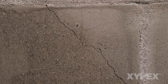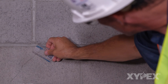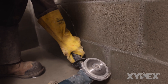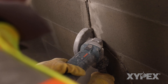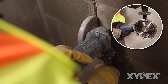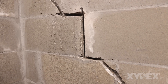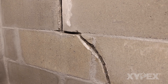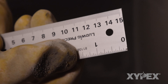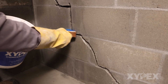Where cracks in the blocks themselves are seen to have been leaking, are actively leaking, or where cracks are larger than 0.5 millimeters, the following steps are recommended. Using an angle grinder, cut a slot along the crack using a crack chase blade followed by a tuck point blade. Angle the tuck point blade to both widen the slot and to create a dovetail profile. Cut the slot to approximately one half inch or 12 millimeters wide to a depth of approximately one inch or 25 millimeters deep. Clean the slot and the area around the slot thoroughly with water, leaving it in an SSD condition.